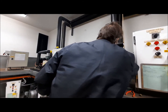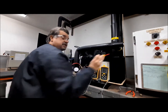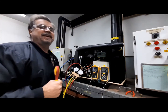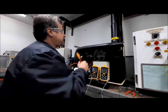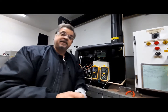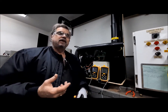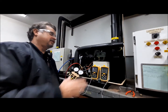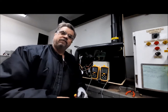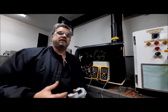I'll bring it down a little bit more. It's only gone up to about 35 degrees condensing at the moment — it's a pretty cool day and this is a very efficient condenser. Look at the size of it; this one's designed to deal with high ambient. If you're going to select a condenser, the first thing you want to consider is what location you're in and how that's going to work in terms of efficiency. Lower climates will want a higher condenser TD just to control that pressure drop, and in higher ambients we want a lower condenser TD. For freezers, no matter where you put them, you want to keep it low. We start messing with our net refrigeration effect if we start increasing the head conditions at the TX valve — that enthalpy change across the valve is going to be more dramatic and we'll lose evaporator capacity as a result.